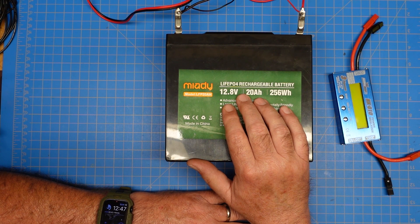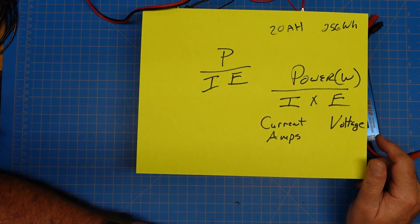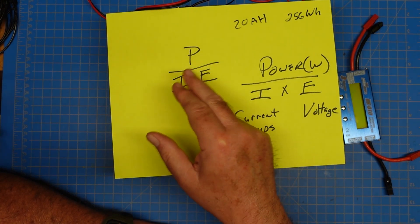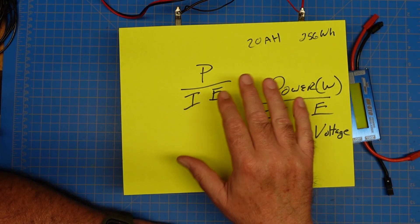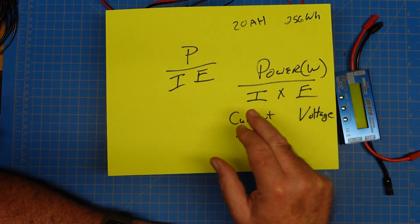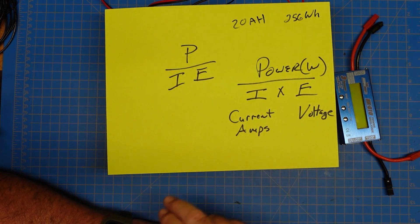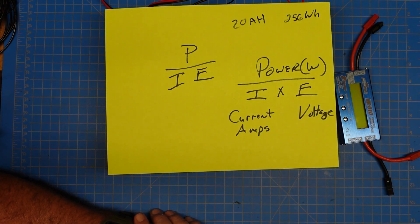When we talk about how much power and current, the formula is pretty straightforward. Power in watts equals amperage times voltage — P = I × E. This is typically a question on the extra test, and I think it's on the general and tech tests as well. You can flip this equation to figure out the other values — if you know the wattage something is rated at, just rearrange the numbers and you can figure out the rest. It's one of the easiest calculations in amateur radio.